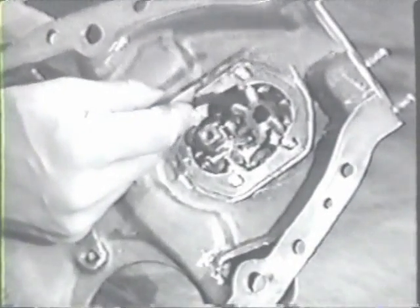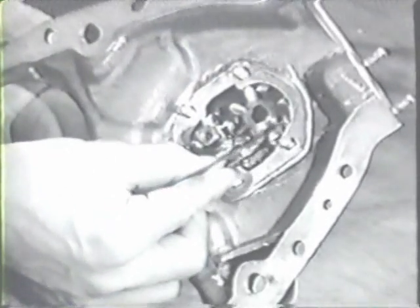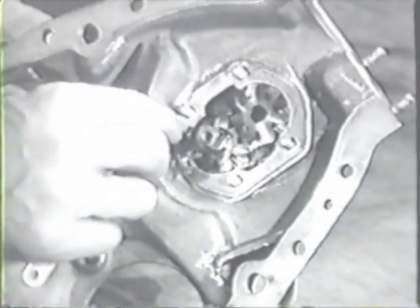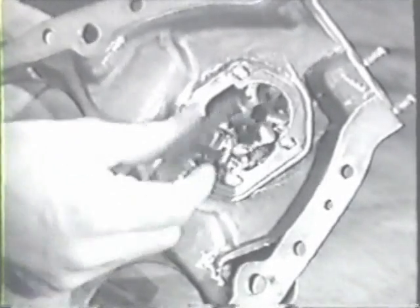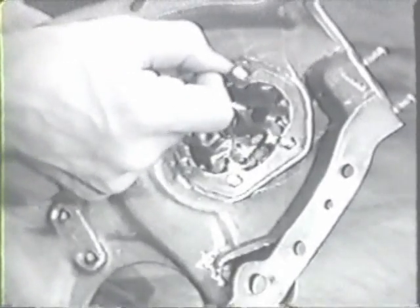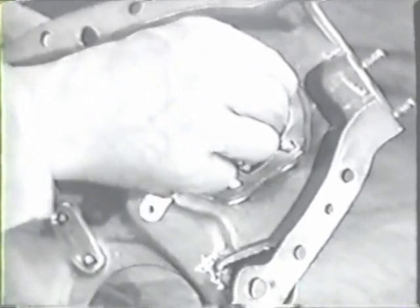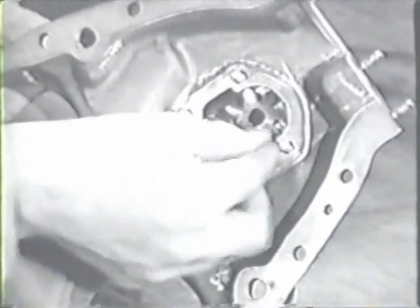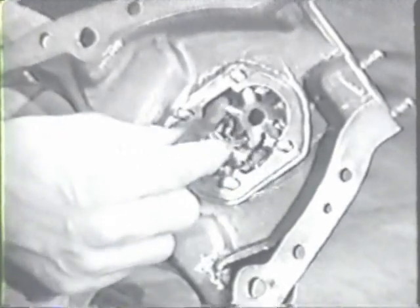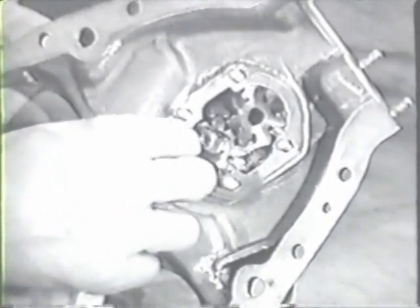To make this check, use a feeler gauge as a go-no-go gauge. Use a feeler one size over the specified maximum clearance. It should not be able to enter between the edge of the tooth and the cover. Then select a feeler one size under the specified minimum clearance. You should be able to insert this one easily. Make this check for every tooth on each of the 2 gears. These clearances are a check on the efficiency of the pump.